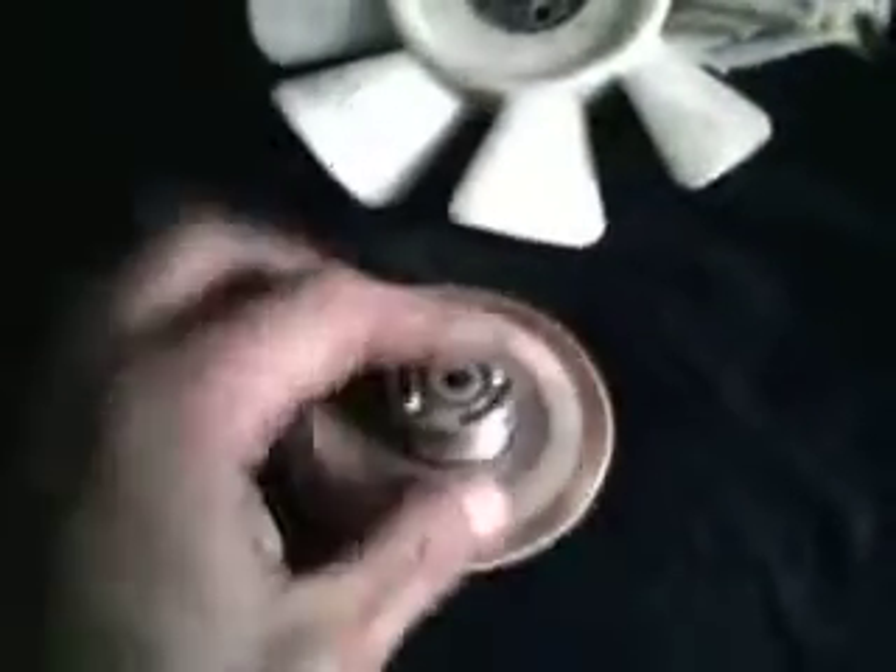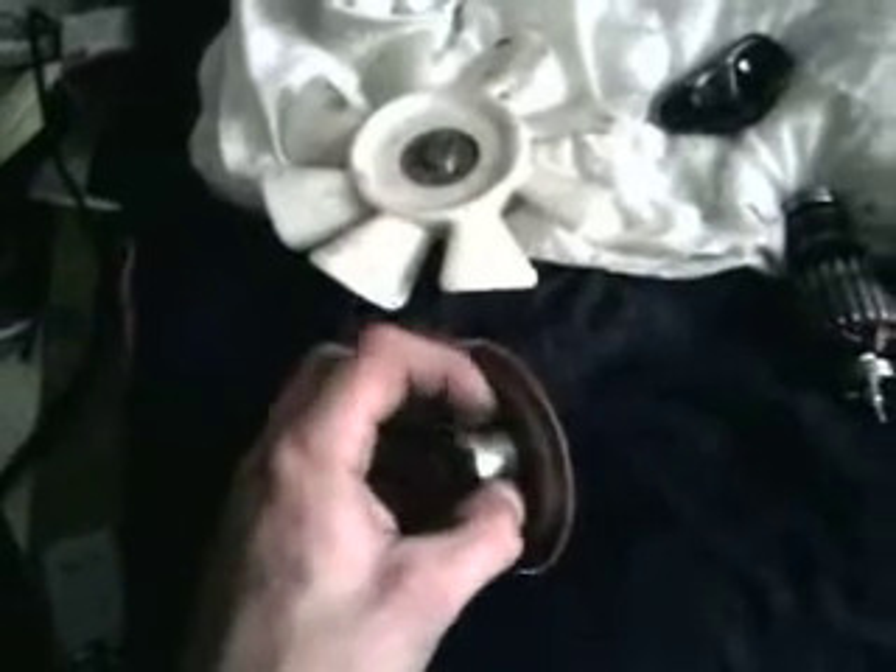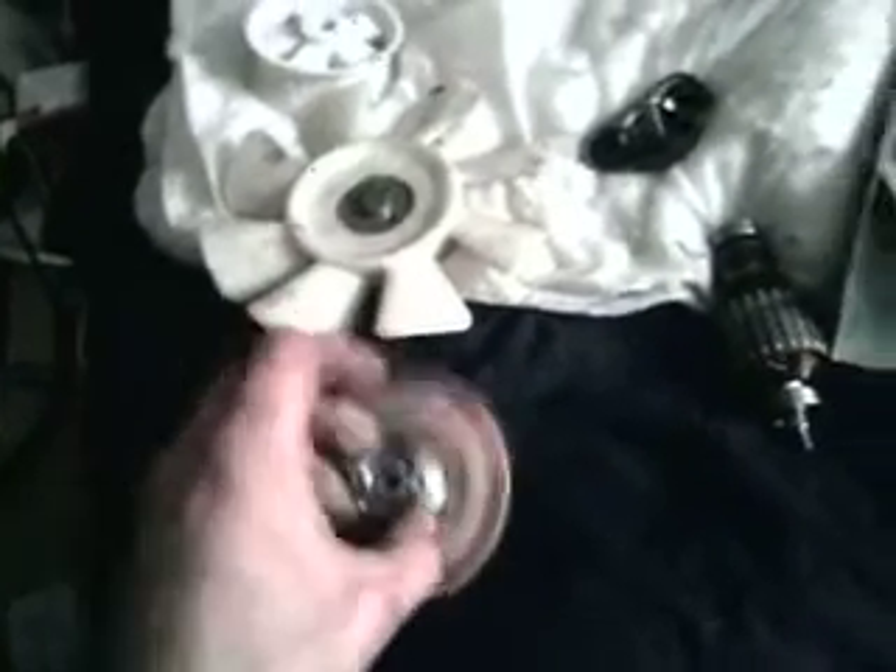I've just got a gear on — well, this is the hub for this one — that'll be stuck on there. From the gap down this side here I'll be driving a pulley which will actually go out to this. Now this is the core of — was it an AC motor or DC? Power goes in — it's a universal motor anyway — but this is the core of one of the other motors that I had. This in itself I'm going to use as the gears.